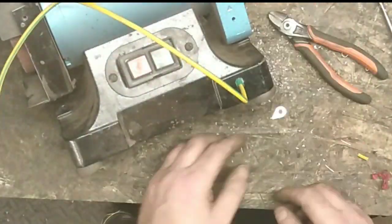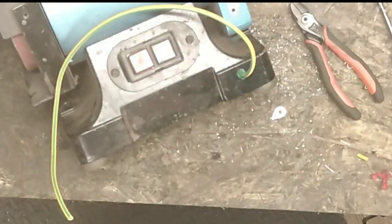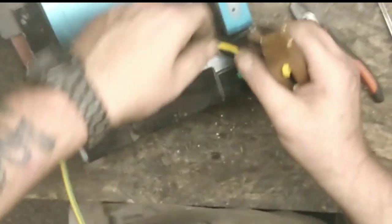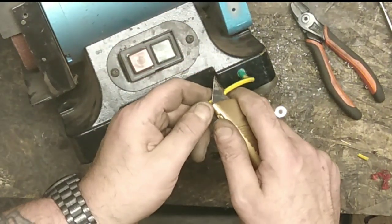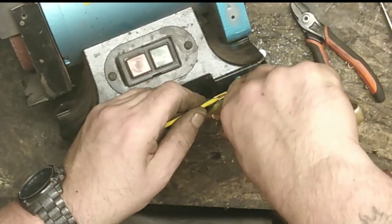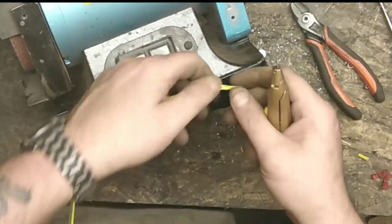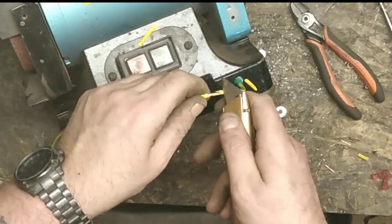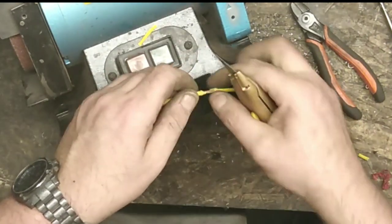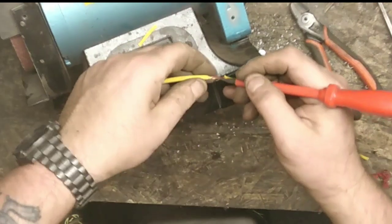Now this here, I believe, is an external proper earthing point, yet there's no bared metal, it's all painted. So I've bared the metal with some emery paper, and I strip this piece of wire back now, but not cut through it, otherwise you're breaking the continuity. This way, the wire's still continuous. Once again, don't copy me, I'm a moron, yeah. Don't do any electrical work yourself, unless you're qualified.